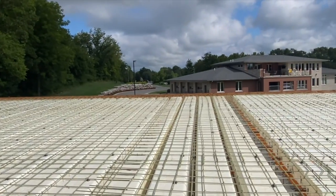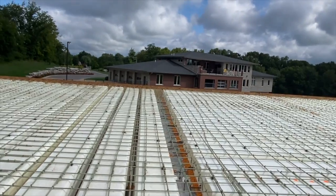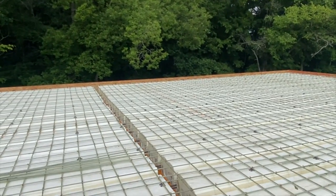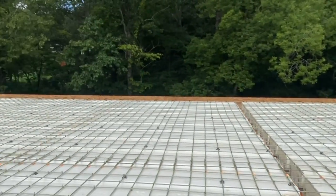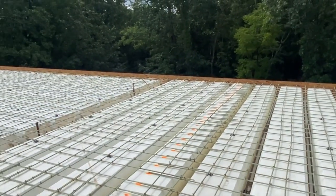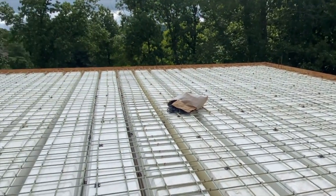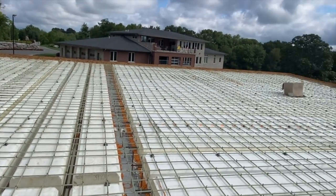This will be nice and flat. We'll probably start building the parapet as soon as we get this poured. That'll be the next thing, and getting the TPO roof on this. The scaffolds will need to remain in place for like 3 weeks, maybe a little more, which the kicker on that is, I guess I told you we'd talk money. They rent that amount of scaffolding, which you saw in there is an absolute ton of scaffolding. That amount of scaffolding will cost you about $8,000 per month to rent. Because you have to leave it in place for like 3 weeks, assuming you hustle, get it up and get it poured, you're going to be over 1 month, but you shouldn't be over 2.